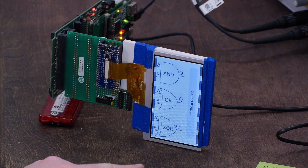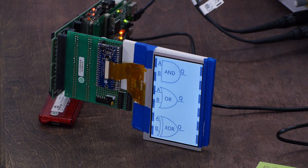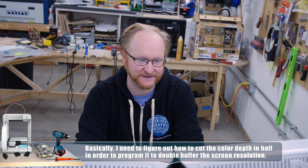This is a 480 by 272 resolution display — about 130,000 pixels. Running at 16-bit color means two bytes per pixel, which means 130,000 pixels requires 260,000 bytes of data — half of the RAM on this microcontroller. We still want to have some sound program and other things, so the challenge is we can't have a double buffer. We basically have to draw it on the screen, which is why you see it updating. With a double buffer we could draw in one buffer, switch buffers, and boom — it appears. However that would take up all of our RAM. So we either need to draw the screen in a non-intrusive way, or reduce to 8 bits per pixel — which takes only 130,000 bytes — then we could do a double buffer. One byte per pixel, use the RAM saved for double buffering, draw it off-screen, and boom, there it is. That's what double buffering means — and there's even triple buffering, and in video games they draw the screen like five times before you even see it.